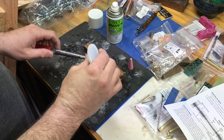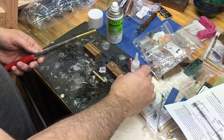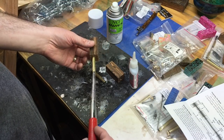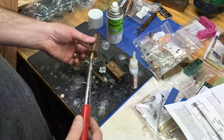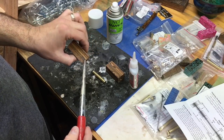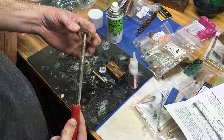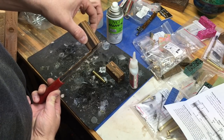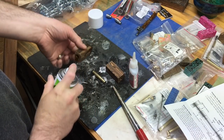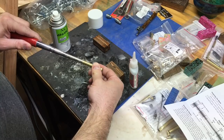I'm applying the CA glue to the barrel and then inserting it into the hole on my pen blank, twisting it and then turning it over and doing the other side to get a thin layer of CA throughout the entire hole. Then I'll push it in and make sure it's flush on one side — the side with the pencil mark. Repeat this process with the other half of the blank, making sure the barrel is flush with the wood on the pencil-marked side. This will ensure the grain is tightly aligned at the center band of the pen.